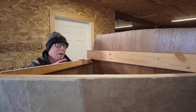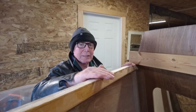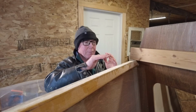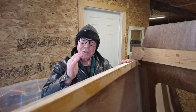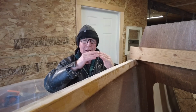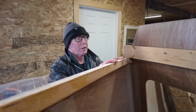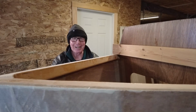Now, I'll tell you what's going through my mind. This is a little working deck, and we're just going to have a couple of cleats. There's not going to be a lot of room to stand around on, so we don't want too much camber, but we want a certain amount of camber, because the more camber you put in, that's curvature, it's like pre-built stress that you're building into the wood. It just makes your material, which is the 9mm plywood, that much stronger when you bend it. So we want a little bit of bend, but not so much that you step on here, you feel like you're going to fall off. We also want to shed water. Okay, I think I've covered that in more detail than I planned to.